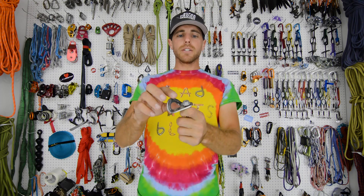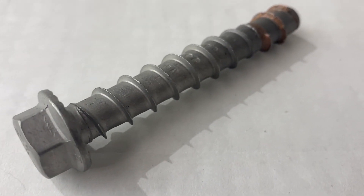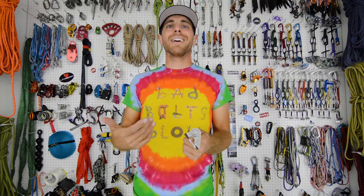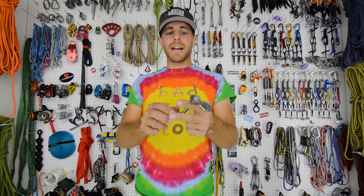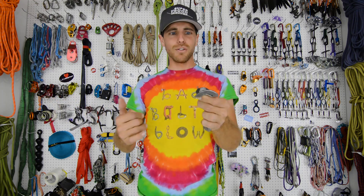Now the way we tested these was with the Titan HD concrete screws. These do require an impact drill — you already have a hammer drill to drill into your rock, but you need a separate drill to install these, because you can't just hammer them in and twist them with a wrench like you do with many mechanical bolts. Glue-in bolts require extra stuff anyway — glue and glue guns and everything. However, if you can take an extra drill, these Titan HD concrete screws have been our life-saving grace for these Bolt Busters tests, because we kept reusing the same holes for all of our hanger tests, over and over. We were getting 40 and 50 kilonewtons before the heads were snapping off.